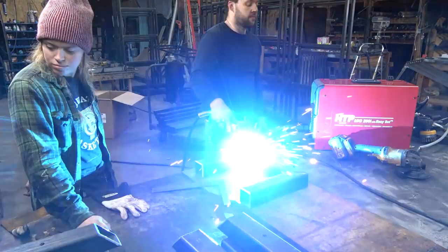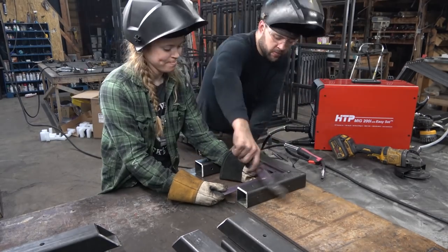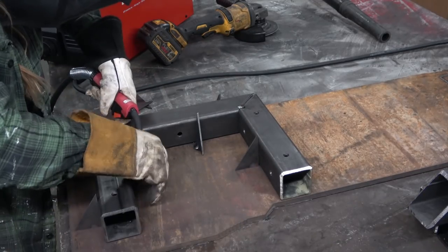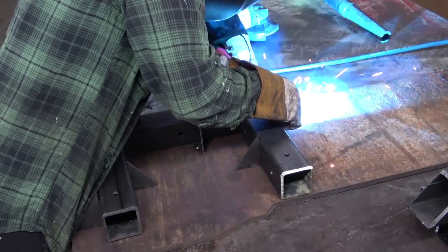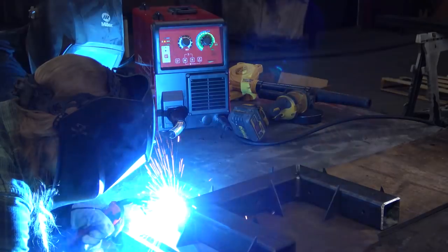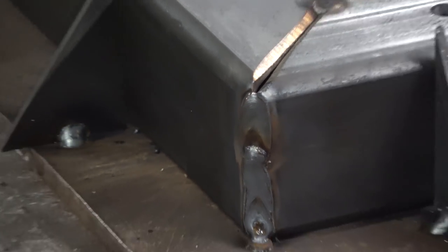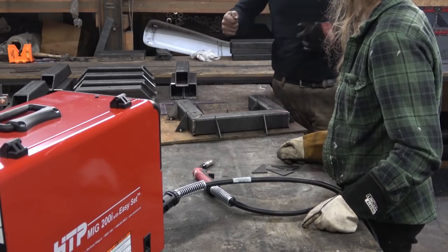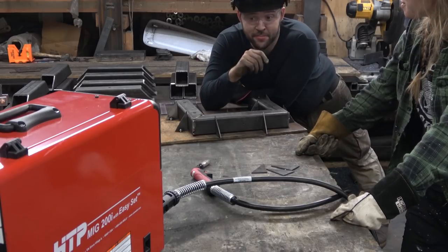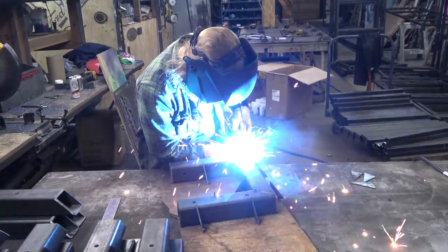This was a cool opportunity — my friend Mary, who I met at one of the maker meetups, has had a good amount of book learning in welding but not a lot of actual hands-on shop experience. She's familiar with the terms, the technical stuff, and has the familiarity to diagnose a problem. We start off by laying up a jig so we can build the first of these feet that will eventually be part of a big bench assembly. It's still a little hot and concave, so we come down off the voltage — let's call another 10% — and try it again.